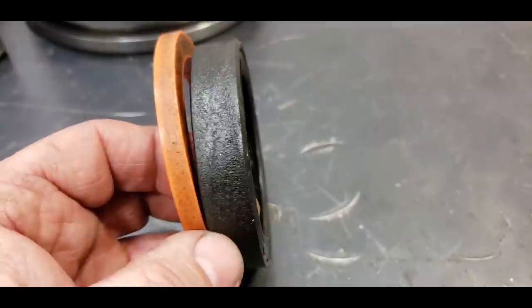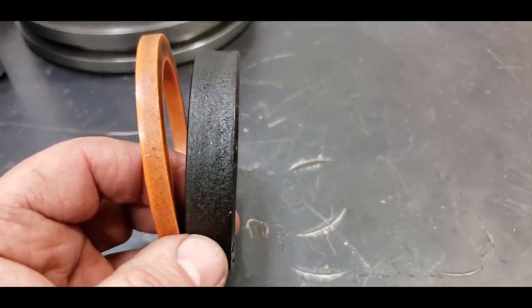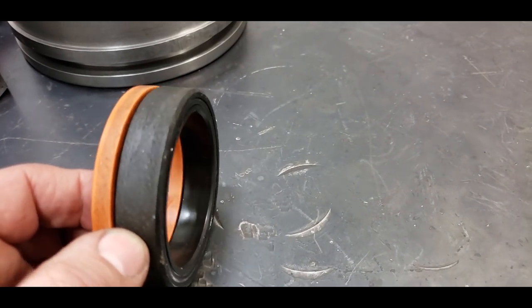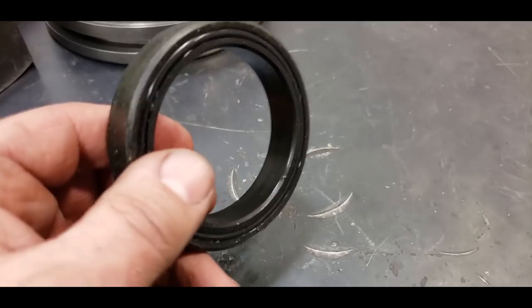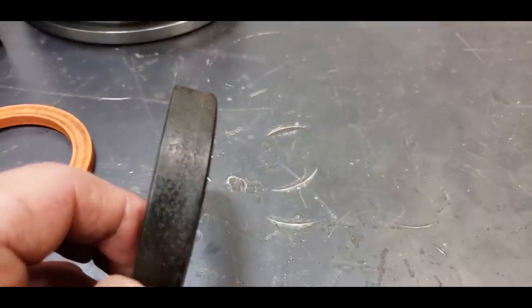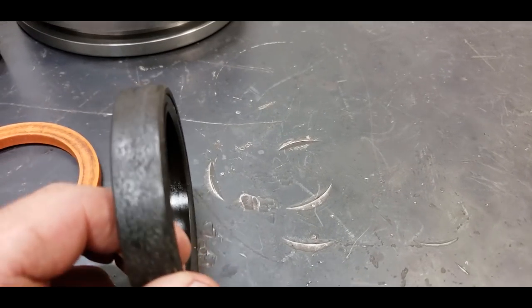Well, it's because that old head that we took off the steering ram on number two, packing tends to destroy the gland in there because it walks and it makes it washboardy. But it's really, really rusty in there. It's allowed water to get in there, and so it's rusted it. And because this moves back and forth in there, you can see that it destroyed it, just pitted it and tore it up. I don't like these.